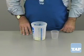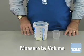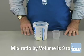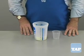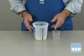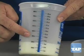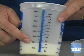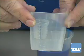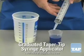But first, let's look at the other method of measuring silicone and hardener. We have seen how to measure by weight. Now we will measure by volume. The mix ratio by weight was 10 to 1; the mix ratio by volume is 9 to 1. This creates an interesting challenge when we start with 6 fluid ounces of silicone and try to figure out how much one-ninth is. There is a simple way to do it — use a measuring container that also measures in milliliters. We have 200 milliliters; dividing by 9 gives us 22 milliliters. Now we can use a small cup to measure the proper amount of hardener. Another method for small amounts of hardener is a graduated syringe.